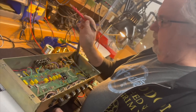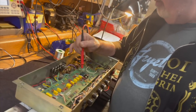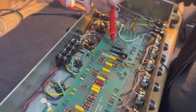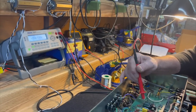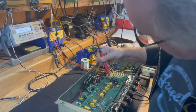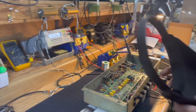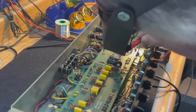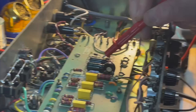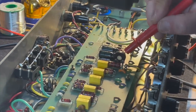So we'll see the bias supply come up. All right, so we have the first filter stage of the bias circuit, which are, let's have a look. Before I shoot my mouth off, is there a date code on these little guys? Somebody that replaced the main filter caps in 1998 might have been conscientious enough to do the same on these, whether or not it was needed. I used to have so many of those suckers laying around. And these are Sprague 1406s, which I don't recall if they were original, but this doesn't look like they've been replaced.